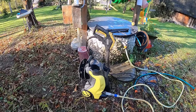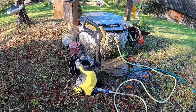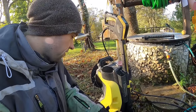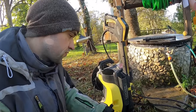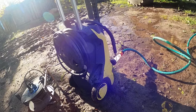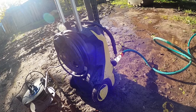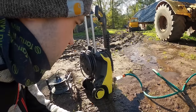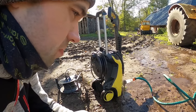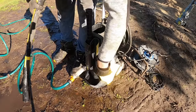Now, overall, it's a pretty good little washer, but the thing is like a Mercedes. If you fart next to it, it will throw up a bunch of fault codes, and it will not work. So I'm trying this method that a quick Google brought up. Apparently there's some type of an airlock, and if that's the case, then the pump just won't turn on.